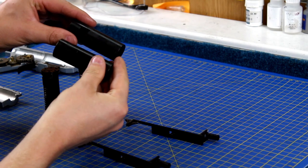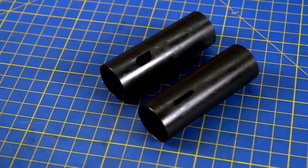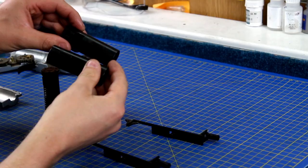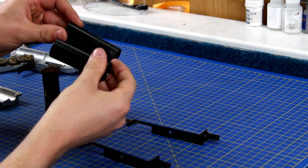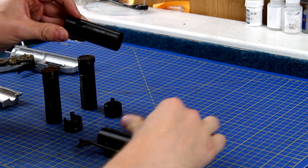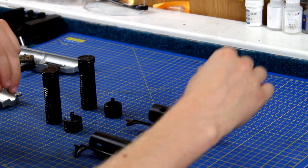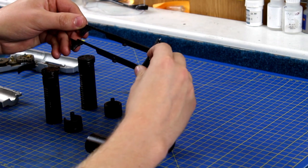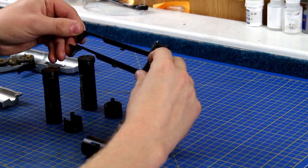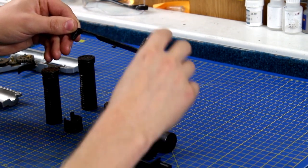The cylinder itself — I've measured them — they're both cut out to the same depth, so your volume of air is the same. You just get a larger window with the new one, and only two holes instead of the four of the old one; I believe that's probably a styling thing. The tappet plate is also slightly different in shape, which should aid in feeding at higher rates of fire if you want to push that.